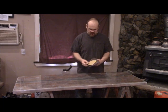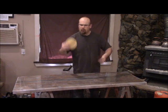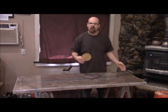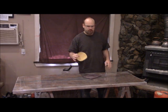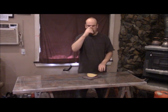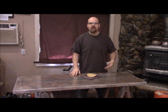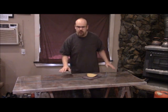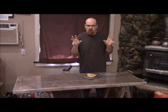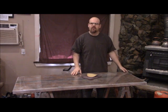I'm using 220 grit sandpaper and a maroon Scotch-Brite pad. Both work, but the 220 grit sandpaper is a little bit more aggressive on the edges. On MDF, when you're putting your base color down and rolling your paint on, you'll want to do a couple of coats, sand in between, and also before your flood coat so that they're smooth. The stone coat likes to penetrate into what it's grabbing onto, so sometimes it's a little rough on the edges.